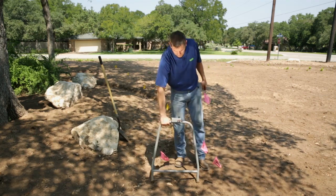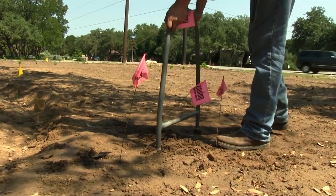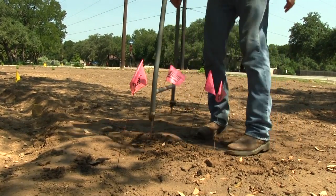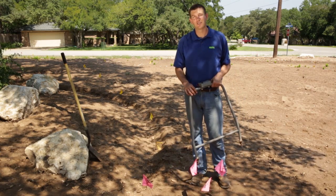The needle's moving to the left, so I'm going to pivot around. Now I know that the fault is somewhere within this grouping of flags. All I have to do is get a shovel and start digging.